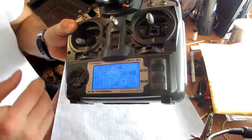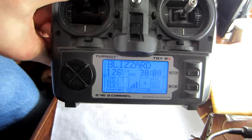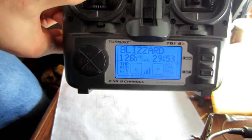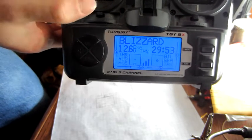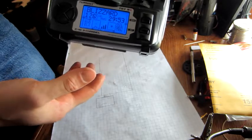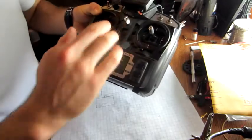I've got ER9X installed so I can see a visual representation of the value of the pot. Today it's working pretty good — it's almost at the top. I could recalibrate but it's not actually going to fix the issue. Most of the time the full travel of the throttle pot is within the bottom 50%, so being inconsistent like that, you don't want to fly — it's probably going to crash your plane because you're going to lose control or come down with no power.